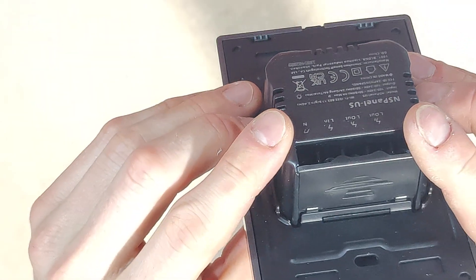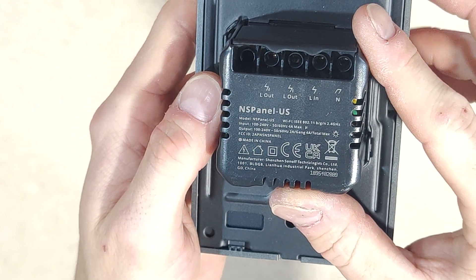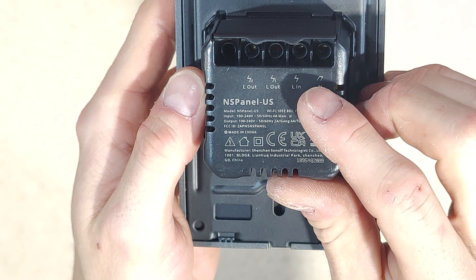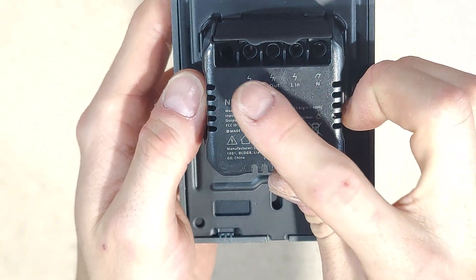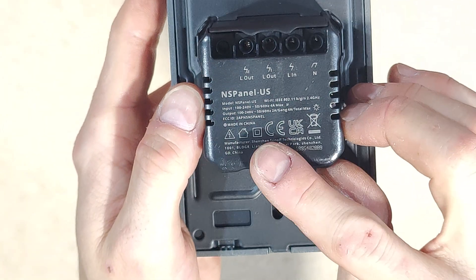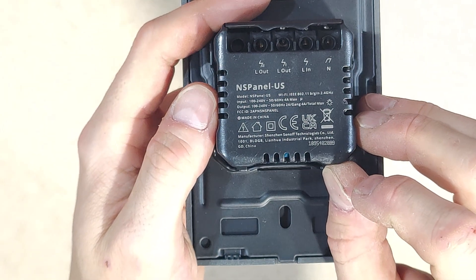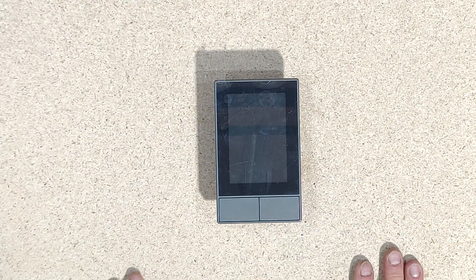You can see the way it works here — I'll put it the right way around for you. It's your live in, live out, live out one, live out two, live in, and your neutral. Your neutral is going to be common to all the connections, but live in and your live out separate to each of them. It's got your specs there as well. It doesn't have the Australian ticks that you want, so it's technically illegal for someone to sell this in Australia, but if you know what you're doing, you can use it.